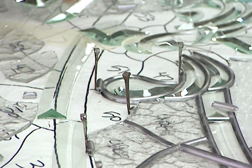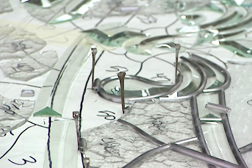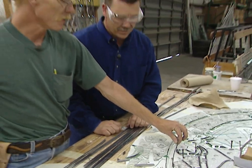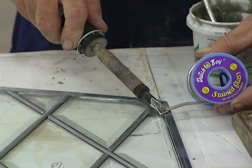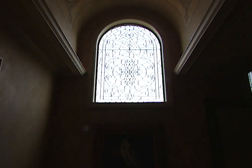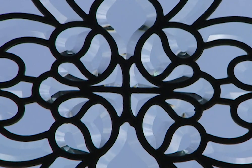These are just horseshoe nails. We use horseshoe nails because round nails allow the lead to bend as you nail it. These flat horseshoe nails keep it very secure and keep it from moving. After every piece is in place, the lead is welded together using ordinary solder. The window is now ready for installation. For some applications, the leaded glass is laminated between two panes of thermal glass for added strength and energy efficiency.